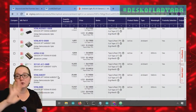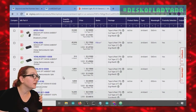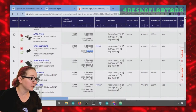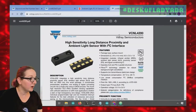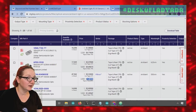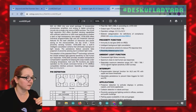To get more detail on which chip from a family to choose, go to the Vishay website where you can search with more specifics. One fun tip: the wider apart the LED and the detector, usually the farther the detection distance. I looked at a couple of these where the emitter and detector are very close together, but then I found the VCNL 4200. What I like about this is first off, there's a lot of it in stock — 50,000 pieces — it's inexpensive at a dollar, and it can do up to 1.5 meters, which is kind of nice.